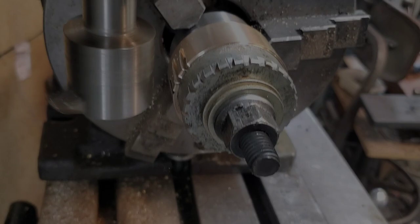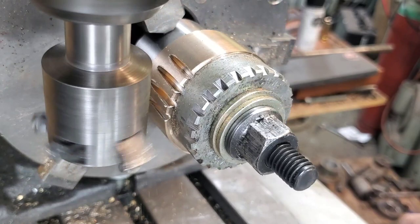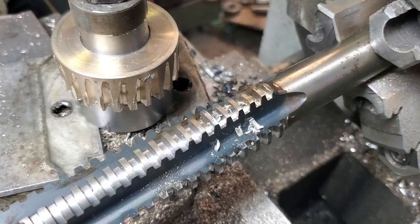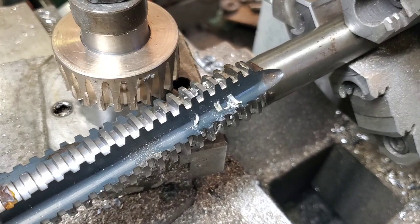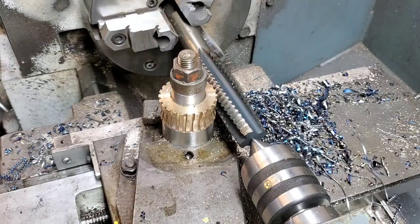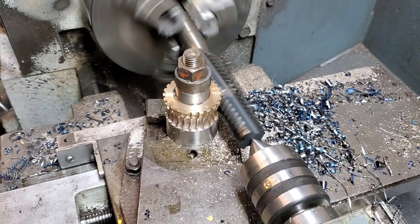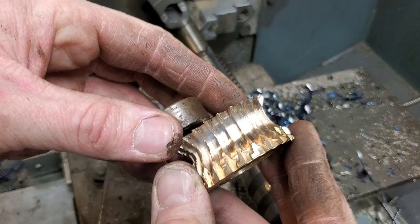This is where I came up with the idea that I should pre-cut the teeth. I pre-cut 24 teeth on each one of them, and it's surely gonna bite in, right? Stay tuned because there's another lesson in here as well. Now I'm gonna match this up — everything looks fantastic. However, you have to remember that it's concave as well, and as we drive it forward, the next tooth has to pick it up. Not only am I cutting it on the wrong part of the tap, it's also not picking up the teeth as the next one comes around. So there's two major problems that happen with this.